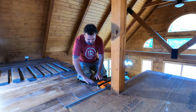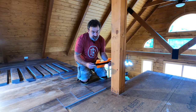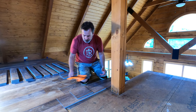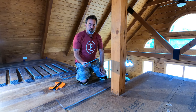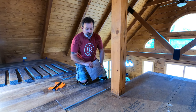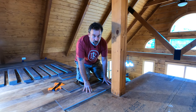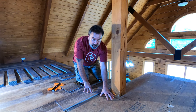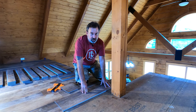Now, of course, the width of the board and how far it engages into the column, this isn't going to help you with. So what you can do, this is really, really slick, is use a cheater board. I mentioned a cheater board earlier. It's just a scrap piece of flooring you've got. And what you do is you set your lay that's going to go in this location around your obstacle. You put it in the previous lay's position.